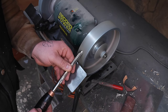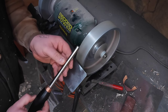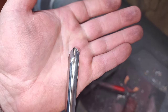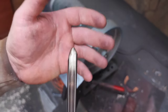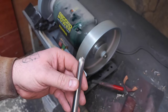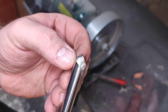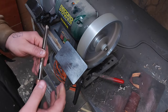I did get a few questions on why I don't use slow-running grinders — well, when you turn it off it already becomes a slow-running grinder. This tool is now sharp and ready to be used. It may not look perfect in terms of the bevel, but I know it's nice and sharp and will do the job. What I've done to this gouge here is actually ruined it — I put a flat spot on it, messed up the bevel quite badly, and put a few nicks in on the coarse wheel.